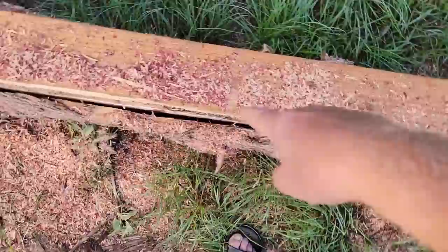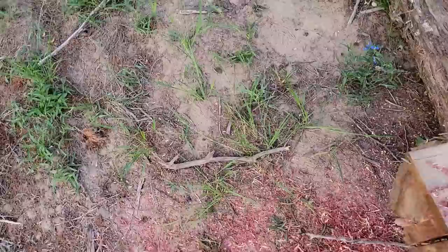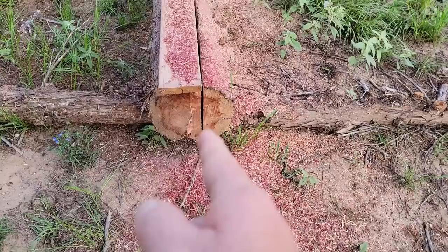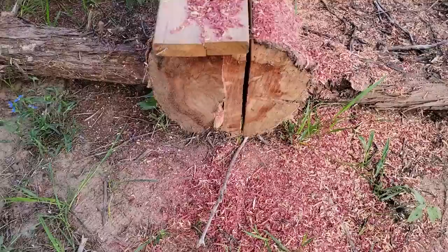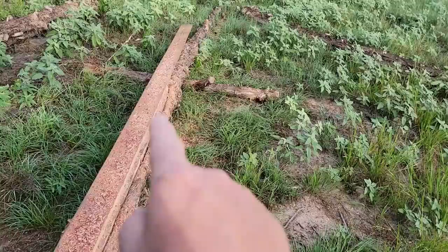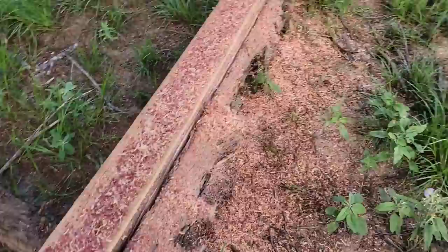I'm going to try to get this end done before the rain comes. From the back I'm going to try to cut a six by six out of there, but if I can't get a six by six then I'll get a six by four or whatever this one ends up being. Then I'll cut one other one so the door frame is framed. I went a little longer than eight foot, so hopefully that will be the header above the door.